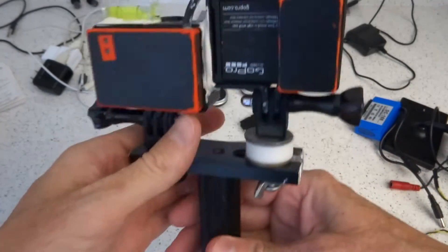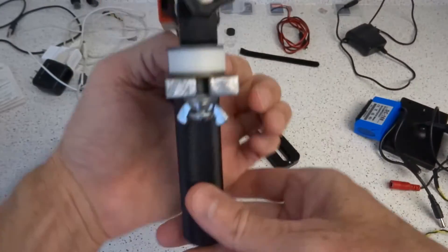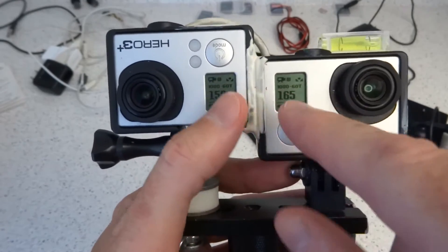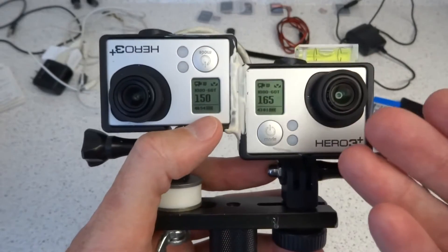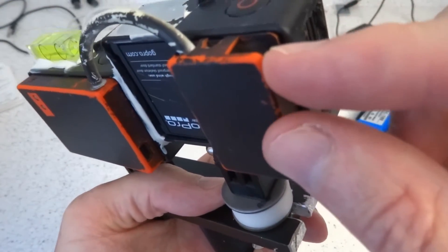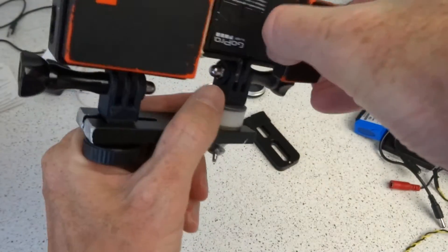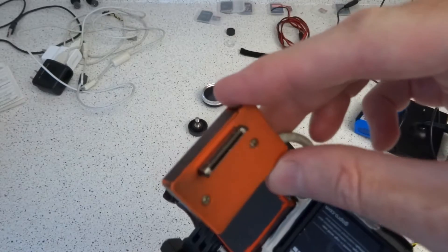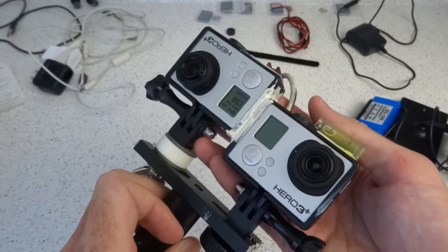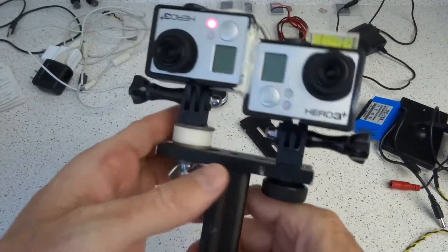The other key thing is these cameras are separated further apart than the original GoPro Dual Hero system. I've modified the Dual Hero system to allow me to put the cameras so the lenses are spaced as far out as possible. Standard GoPros want the lenses very close together — that's just not big enough for most situations where you want to see some 3D depth. The modification is simple: you just open the back up and you can see there are two screws, and it's pretty simple to move the wire over to the other side. Doing that allows you to put them much wider and it still works perfectly — the cameras still both communicate totally fine as the Dual Hero system works in exactly the same way.